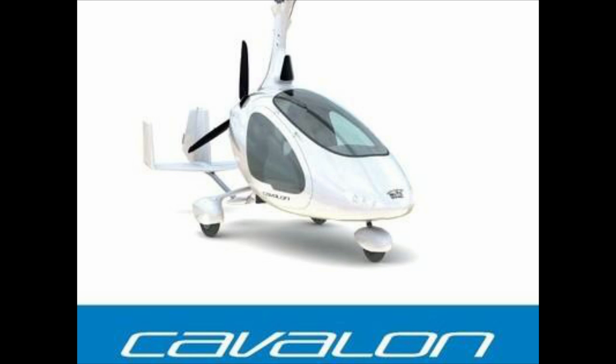Don't go down that rabbit hole. In the UK, the 915 Cavalon is approved for flight to 560 kilos, but the empty weight is usually more due to the motor being heavier and the inevitable extra spec typical in what is seen as a premium product. The empty weight on the aircraft in this film is 340 kilos, so you just have 220 kilos of headroom — and you need fuel. Add 30 kilos of fuel, which might scrape two hours of flying, and now you have 190 kilos for people and stuff — maybe two times 90 kilos for people and a bag, a spare can of oil, and a couple of bottles of water.